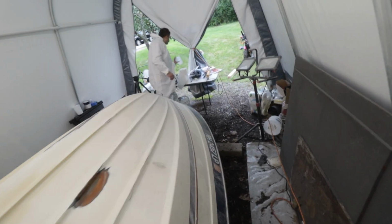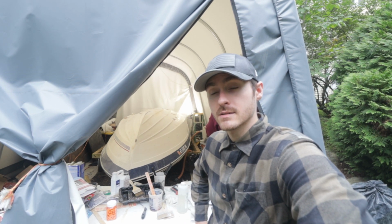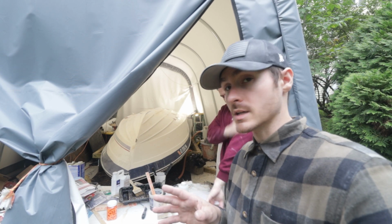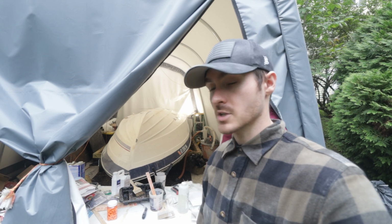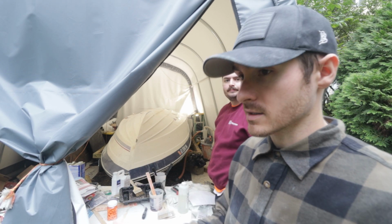It's looking good. All right, that's another Sunday in the book. Pretty far along the way of already getting to the point where we can gel coat. The right side has 2 layers of 1708. We're gonna finish with 3, and then a layer of chop strand so that we can smooth that out, use fairing compound, and then gel coat over that. So we still got to do the left side. We have some patches, the first layer, got to do the second and third.